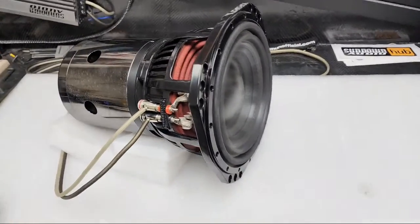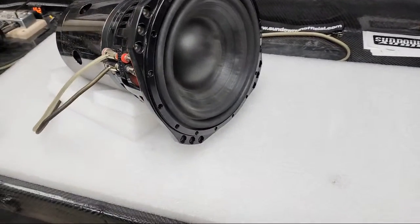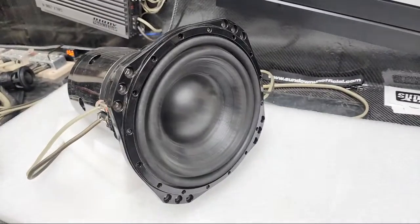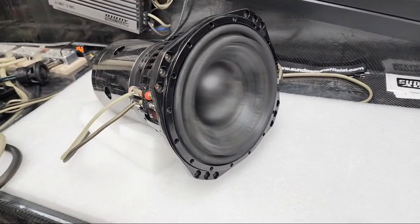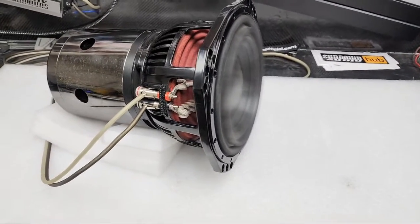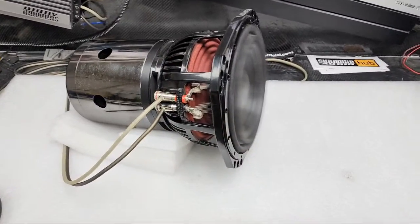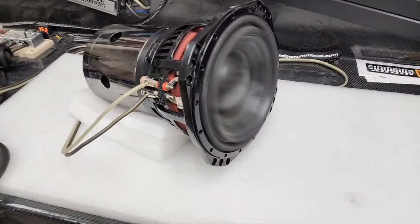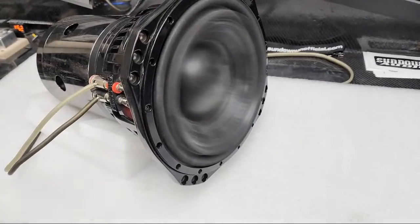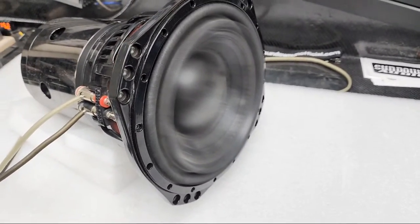We're at 30 hertz. 30 hertz really messes with the frame rate. And yeah, keep in mind, we're not in a box. There's no enclosure. So we're going to hear all that mechanical noise from back there on the back end. But there's 30 hertz. Looks like it's not moving at all, but it's stroking about 1.5 inches, top to bottom over here.